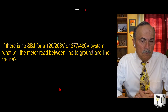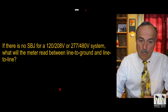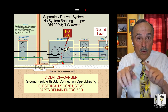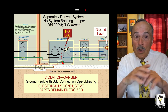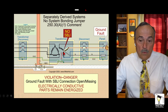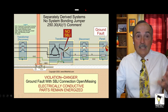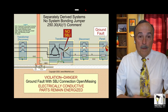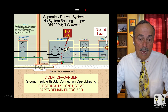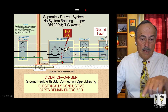Second question: 'Mike, if there is no system bonding jumper for a 120/208 or 277/480 volt system, what will the meter read between line-to-ground and line-to-line?' If you don't install a system bonding jumper on a slash-voltage-rated system — meaning there is a neutral with neutral-connected loads — then you must install the system bonding jumper because it's a solidly grounded system. If you don't, it becomes an ungrounded Y system, which is a violation because those neutral-connected loads require the neutral to be grounded. It's 250.20 that talks about what systems must be grounded, and this is one of them.